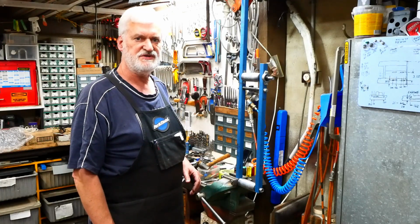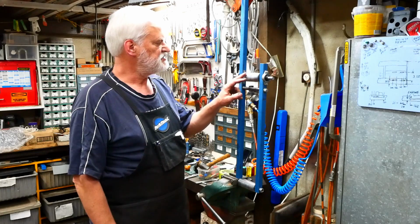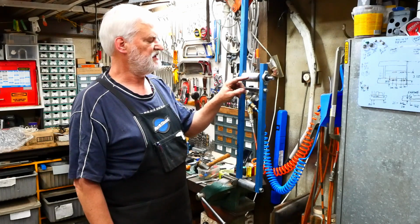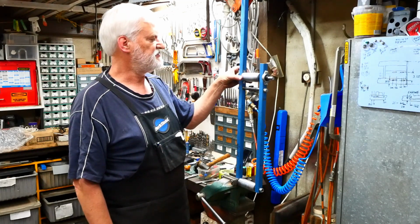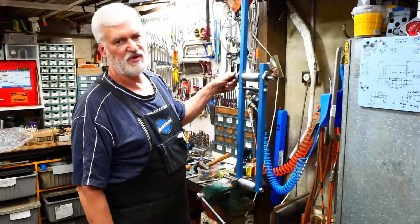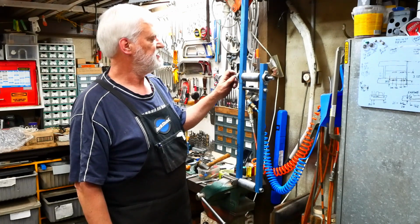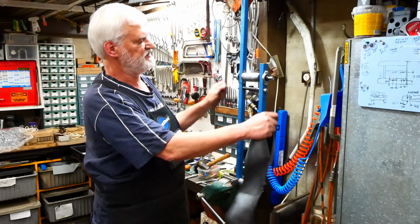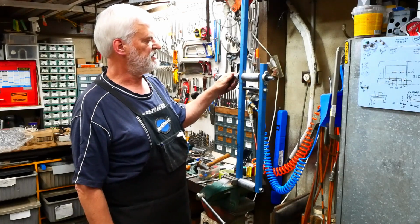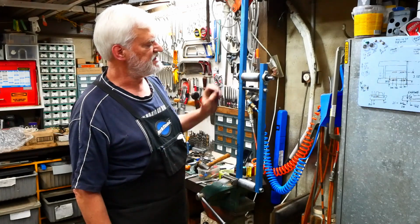Okay, so I think I'm making some progress finally. Got the bones of this thing sorted, so that roller's done. This one here is the one that has the bushes in at each end, and whilst the bushes are pressed tightly into the roller, at the moment it's free to turn on the axle. So I've got to do probably some tack welding. It won't take much because there really isn't much force to be transmitted. These bearings have a small amount of alignment capability, so I haven't got them quite right yet. You can see it's not completely happy to turn over, but it certainly seems to work.